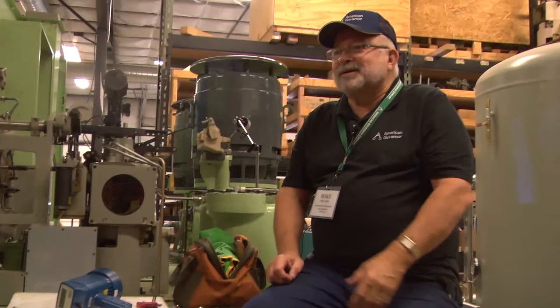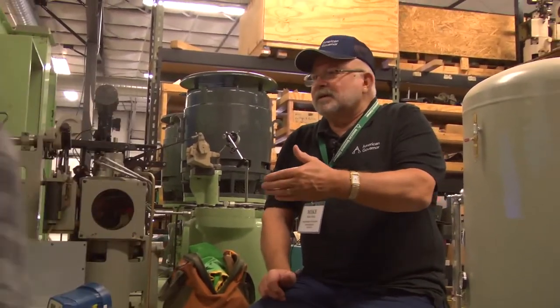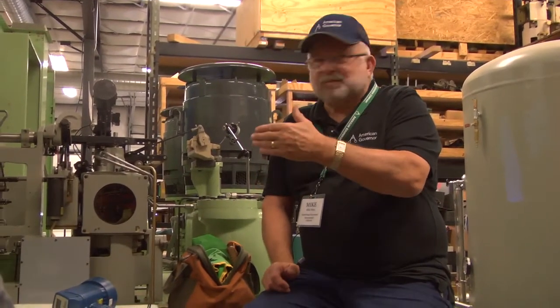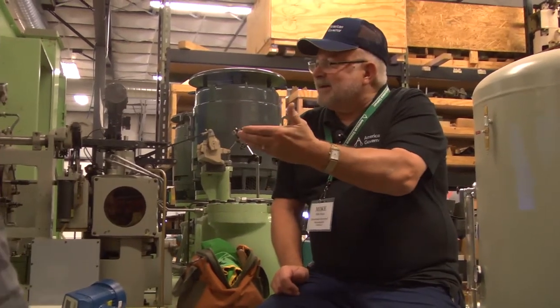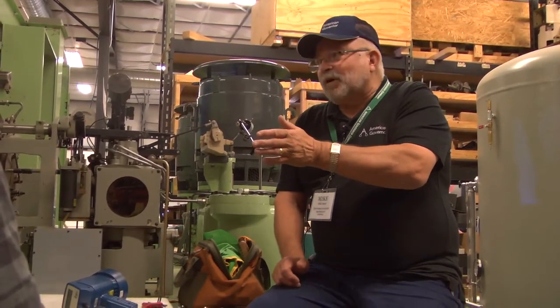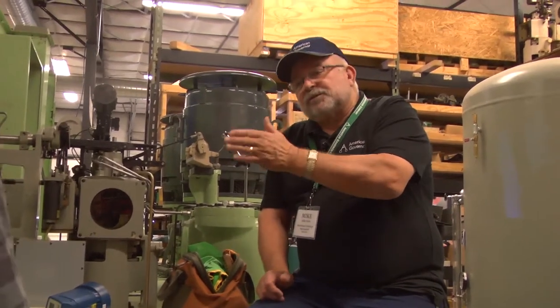Oh, yeah. Or, you know, we go from standby to online to condense, we might do that 2, 3, 4 times a day sometimes. And other days, we won't, they'll be in standby for a day or more. But I've heard some of the units. I mean, the best thing for any kind of, whether it's a valve, a governor, if it runs all the time, it's good for it. Yeah. If you don't operate the valves, why do you think they have regular periodical tests on head gates and everything else. So you have 6 months partial closure test, and it's in your guide to tell you, a valve that just sits open all the time or closed all the time, you don't want to have to open it in a hurry or close it in a hurry. It may not work unless you test it periodically.